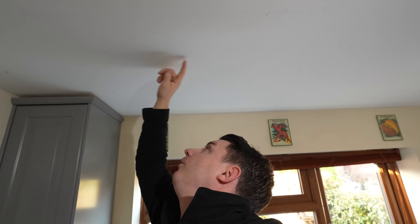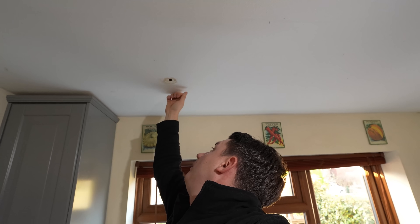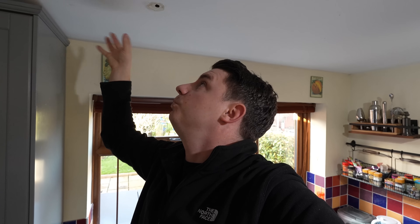I don't think we've got any option but to cut a patch out of here. We have a joist which is roughly here, as well as one about there. So we'll probably just cut a square out and hopefully it comes out in one piece. Then we can just stick some wood in, put that patch back up, screw it all up, and it's just a fill and paint.